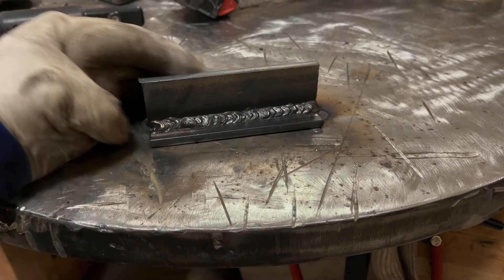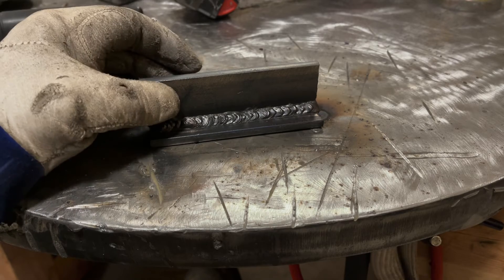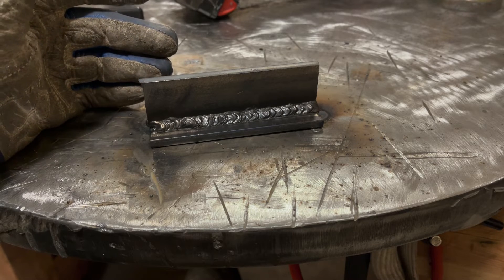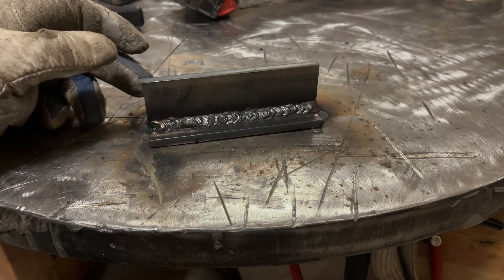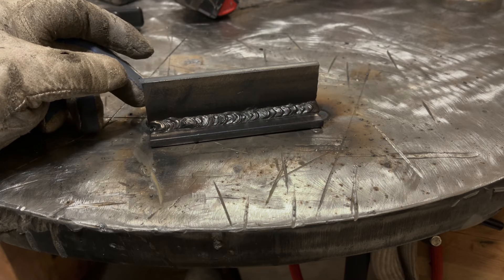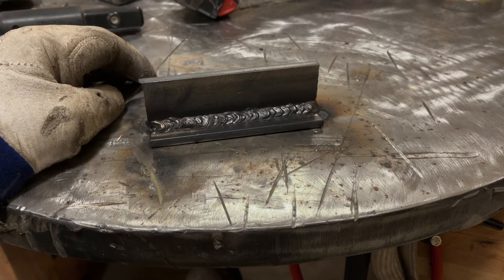The camera battery died — gotta love it. So this was the second weld, equally as terrible as the first. All I did was put a 6010 on the stinger and run clean over it. Overall it welded pretty decent looking — you would never suspect the problems inside just by visual appearance. I'm going to bust this one off the tack, finish cleaning it up, and then we're going to cut and etch both of these and look at what's inside.